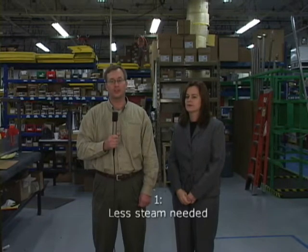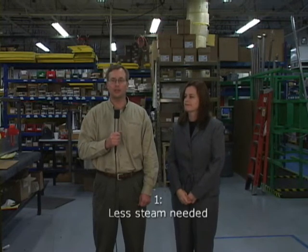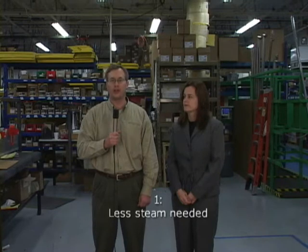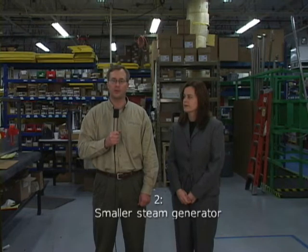Thanks, Jim. We've probably heard enough about the engineering challenges to bring this product to production. Tell us the five ways that insulating tubes save customers energy and money. Insulated dispersion tubes provide savings in many ways. First, since less steam condenses in the dispersion tubes, less steam needs to be generated to maintain a given humidification load. And as you know, it takes about a thousand BTUs to heat and vaporize a pound of water. Second, in some cases, this increased efficiency allows the application of a smaller steam generator.